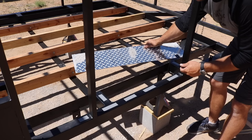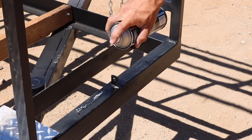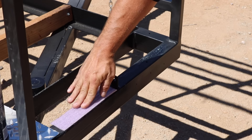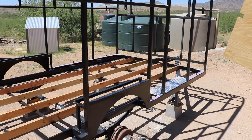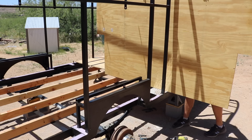For the sill of the doorway I used aluminum diamond plate as the support structure underneath, since that area would be most subject to water draining and pooling, and it also keeps the plywood floor a bit further from the door's edge. On all of the outsides I placed a little foam between where the plywood rests against the steel frame, just to allow a little drainage so water doesn't get stuck between the wood and the steel.